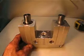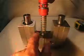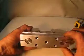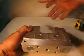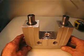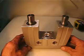You can put the machine screw on top. Build the base with the nut inserted inside, all the way to the end. You need another block of aluminum for the end. Then on top of that, you create the flex coupler plus the stepper motor or servo motor.